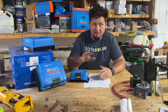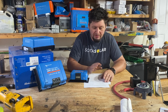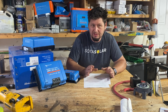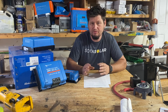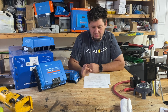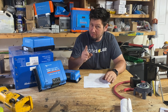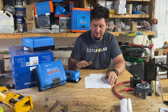When you start adding even more components, you can save money on your Lynx distributors too, since you only have four inputs and outputs. On a 1600 watt solar system with about 400 amp hours of battery, that 1600 watt system on 24 volt is $500 cheaper in parts alone — figuring in wire, solar chargers, everything. And there's probably a question you have about running these higher voltage systems that is also covered in that $500 estimate.